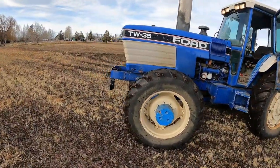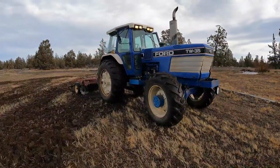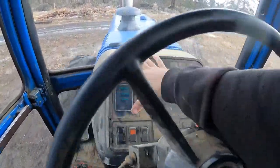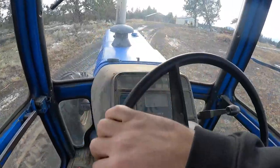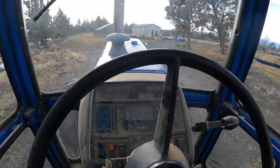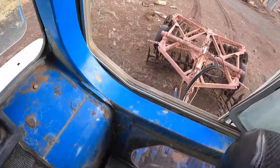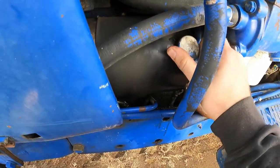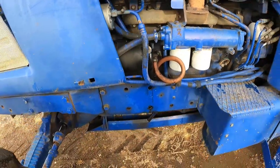We've been running it around for probably 20 minutes, getting the batteries all charged up. Lights working pretty good. Everything's all okay. And the steering's really good too. Shut her down. Put that in gear. T-brake. I'm gonna lower this guy down too. Good to go. We'll go ahead and check on our steering pump as well, see if it's holding any fluid. Oh yeah, no frothing. We'll just have to keep monitoring that and we'll check it when springtime comes around.